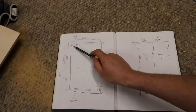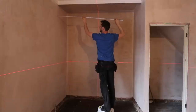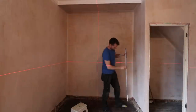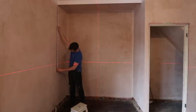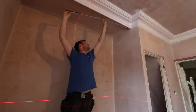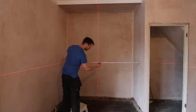If you're just measuring a flat wall the line does not have to be cast in at 90 degrees — you can just turn your laser level on and start measuring. It's whenever you're measuring an alcove or a door lining through some walls that you want to make sure the laser is cast through at that perpendicular angle. I do a drawing of the rough opening with a dotted line through it indicating where my laser line sits, and the measurements I take are all references from that laser line. You want to do this for several points throughout the wall to get a good idea of which way the wall is falling. The longest measurement at any point is going to give you the width or height of your frame, allowing enough timber to scribe it in place. I like to use a wooden folding rule for this because you can adjust it to the length you need and it stays in a straight line — a lot easier than trying to keep a tape measure straight across a span of up to two meters.